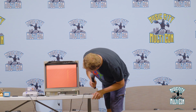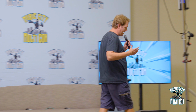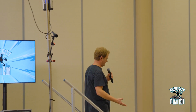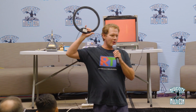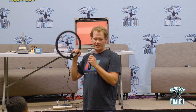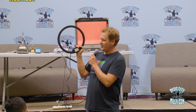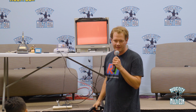But just so you know, this is a pretty specialty tool, and it can be dangerous and a fire hazard if you don't know how to use it. That's really a rare situation where something like that would happen. But this thing right here is called a degaussing wand, and it is a commercial piece of equipment that generates an enormous amount of energy. It's going to generate a magnetic field, and you can't keep running it too long because it gets extremely hot and it'll melt. So you don't want to use it for more than 2 minutes. And that's really the big warning.